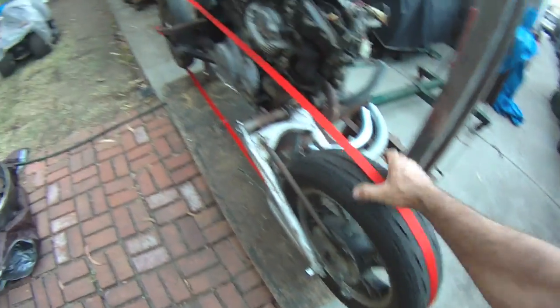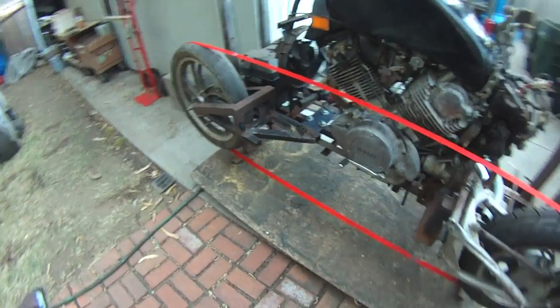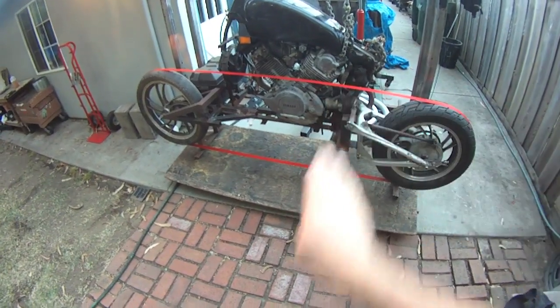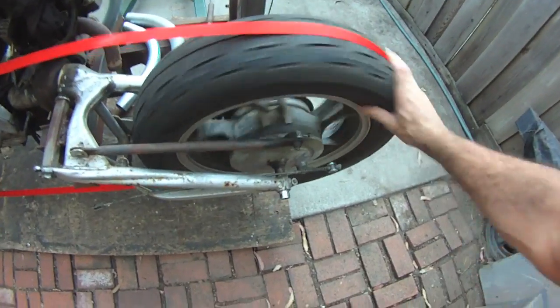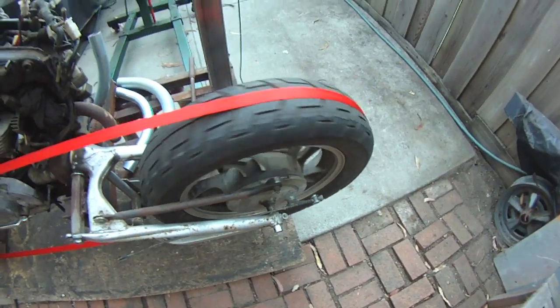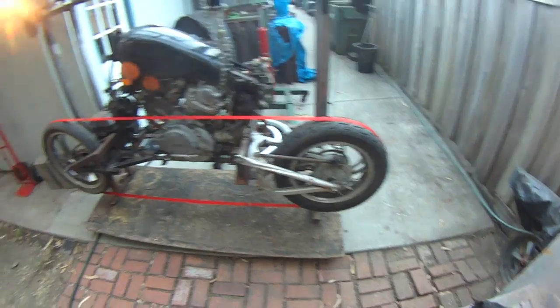So this wheel will drive like this. It's going to drive the bottom of the chain like this. Regardless of which way this trolley cuts, whether we feed from this side of the blade or from this side of the blade, the rotation is the issue. And I am going to retain the drum brake to be able to lock the drive wheel if something goes bad and I need to shut everything down.